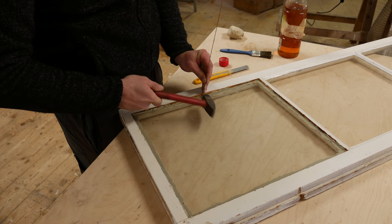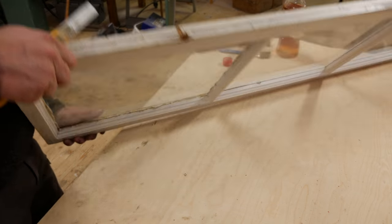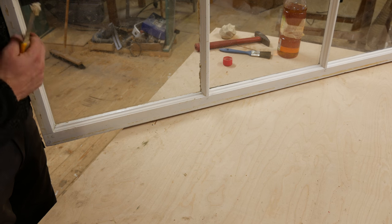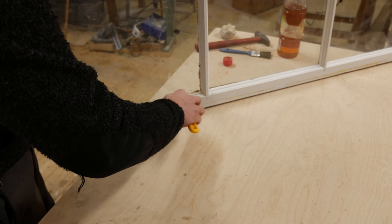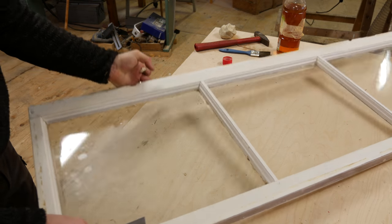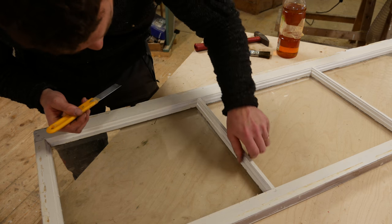There you go — break it off. It's all nailed on now. The first thing you want to do is lift it up and you'll see the putty here — scrape it off like this, because when you put putty on from the top you need to see the border. If you see any gaps where there wasn't enough putty, now is your chance to apply more. You could also use this stuff to fill broken wood and paint over it later — an easy fix for minor damage.